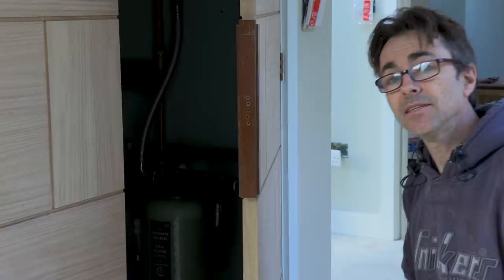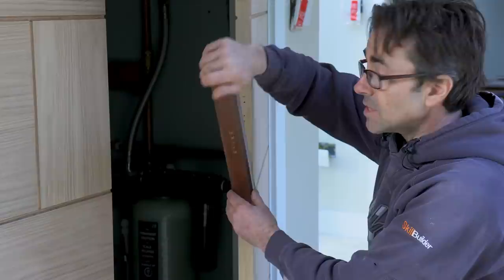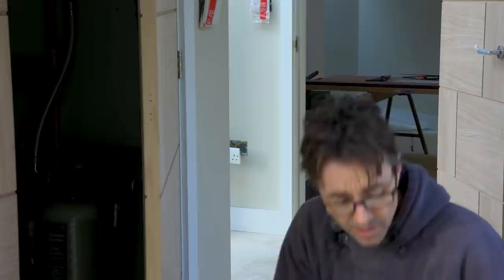The device I'm using to put these latches in is by a brand called Peter Sauber, which you attach to an electric drill to actually route out the mortise and the face plates. You just finish out the corners - in my case with a corner chisel. Because I had a lot of doors and a lot of latches to do, it was worth making up this simple device.